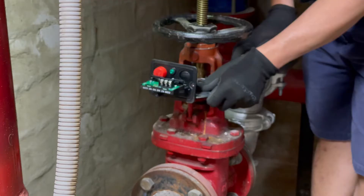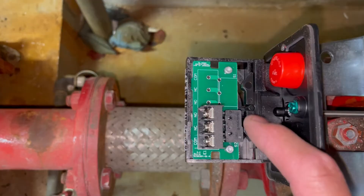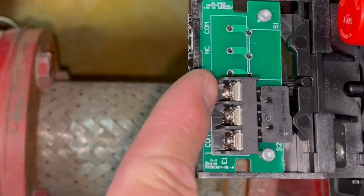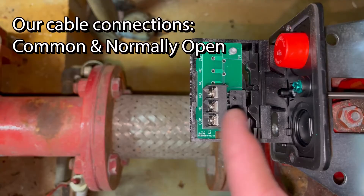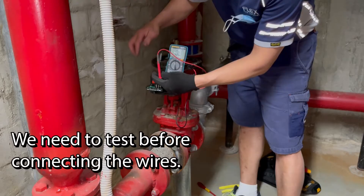The way we connect the tamper switches — there's a micro switch in the middle. This movable part has to be sitting there on the tamper. Any movement will create a change from a normally open circuit to a closed circuit, short circuiting the wire coming from here and creating a short circuit alarm in the system.